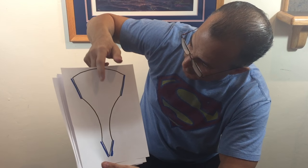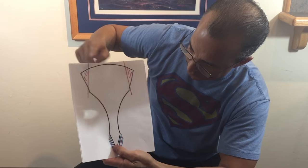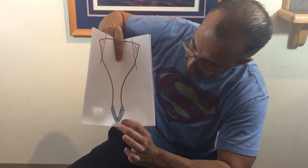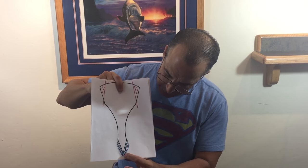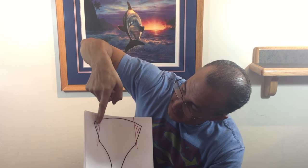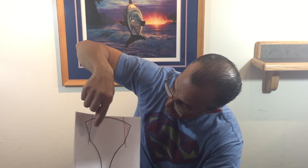I don't think I'm the first one to do this — I think I gave it the name, but I'm sure other people have done it. What I do is put four layers of tape on the edge. Why four layers? Honestly, it was arbitrary — I just picked four and it worked out really well. When I lay the razor on the stone with the tape on the edge, it pitches the spine up — that's the back bevel part — and what it does is knock the ends of those wear bars off.